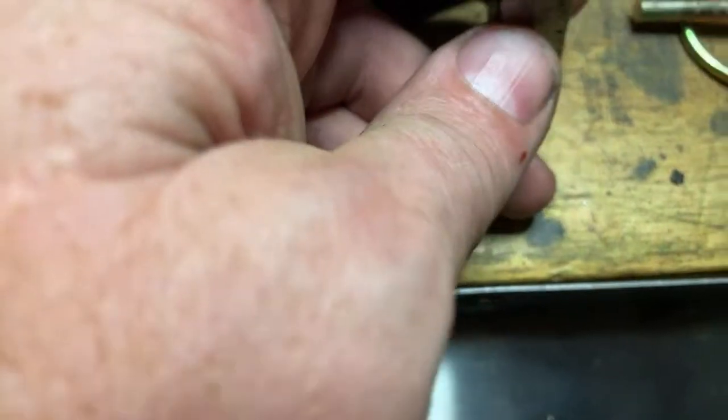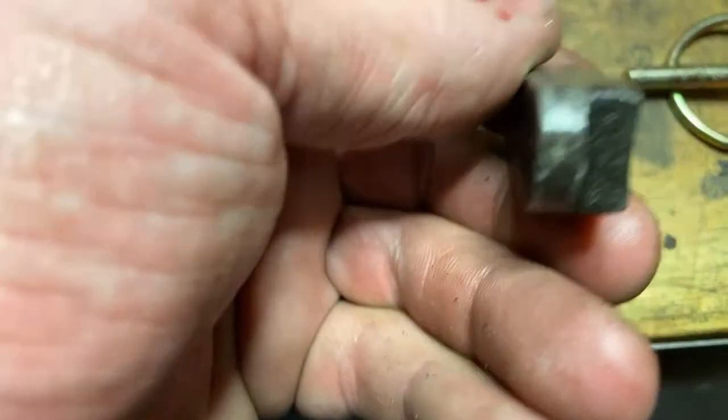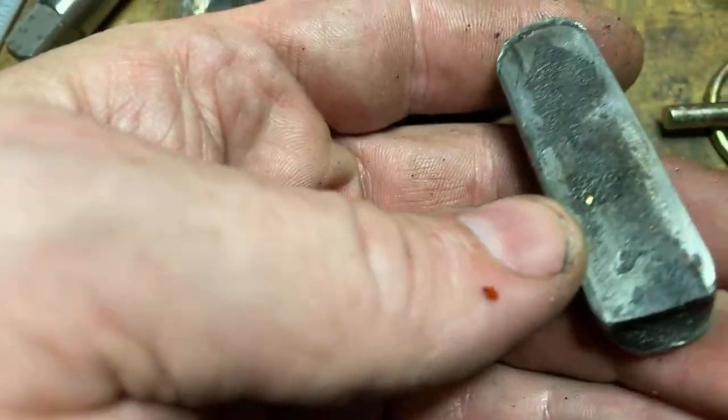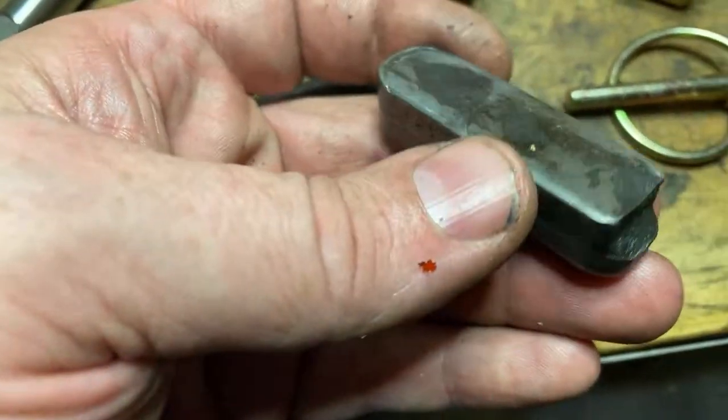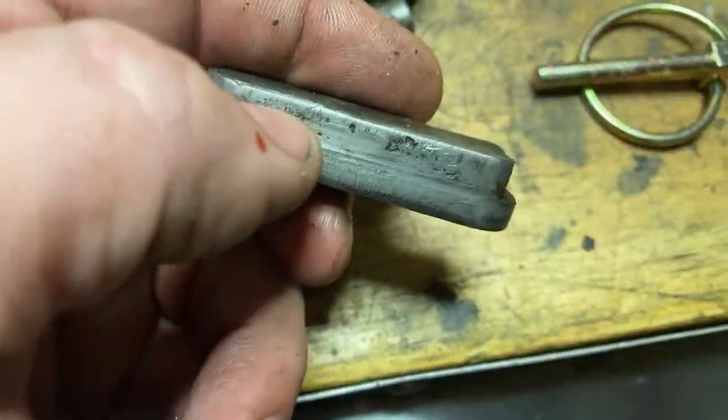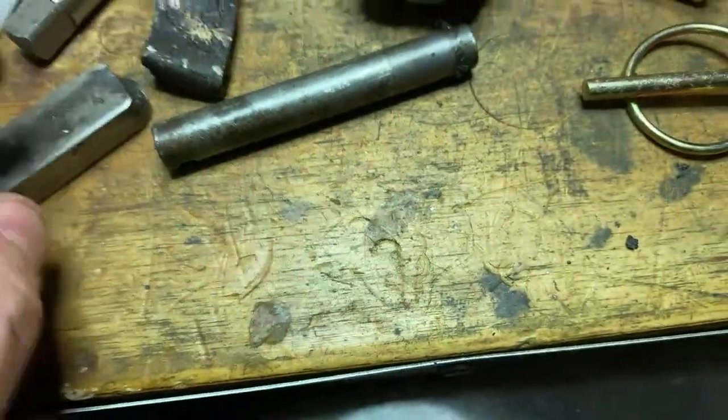You've got to be here first up if you want to look at the lathe. And it's a bit loose in the shaft, so I have to make a new one that's a bit oversized if we're going to put it all back together, and then probably just machine half of it off to fit the new one. Job's done.